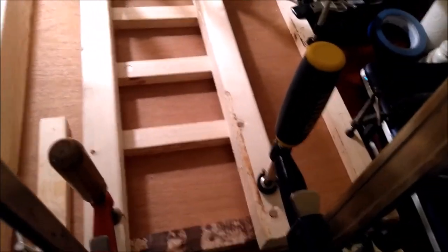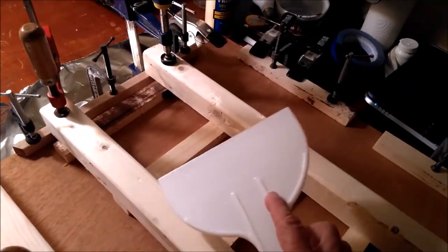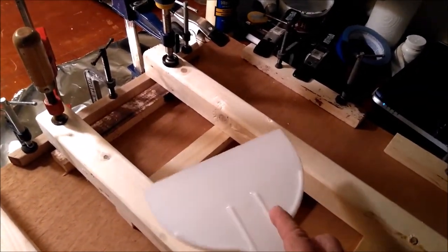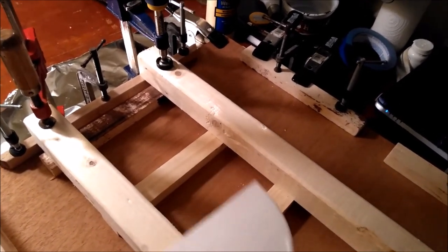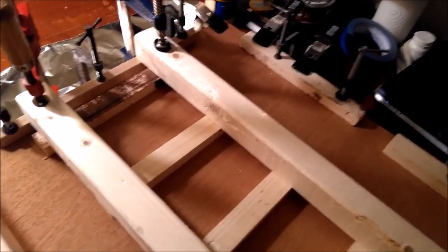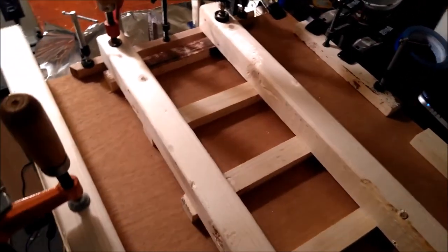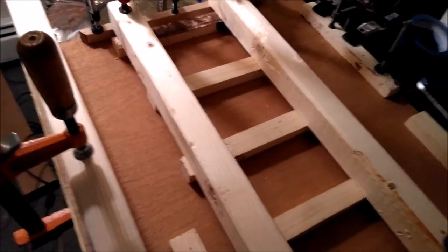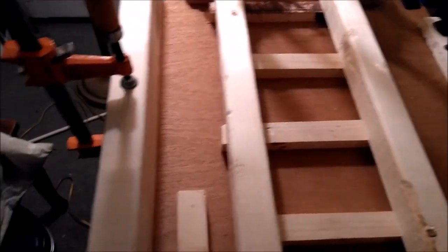By the way, when doing the glue, remember, not only are you putting down lots and lots of glue, but use a large spatula like this to spread it so that every single centimeter of the entire surface of your glue-down area, in this case plywood, is completely covered with glue. Once that was done, it was a fairly simple matter. I took my new mahogany and put it on top, and got everything lined up.